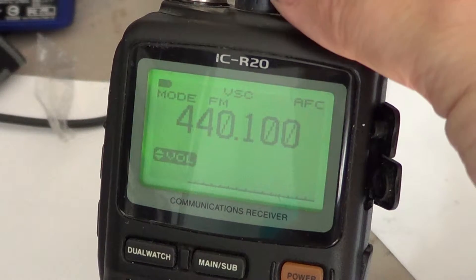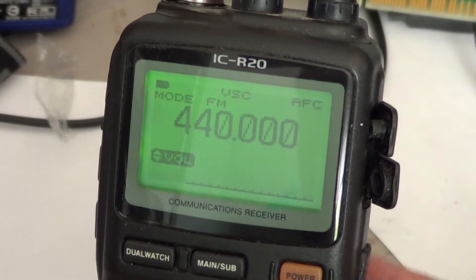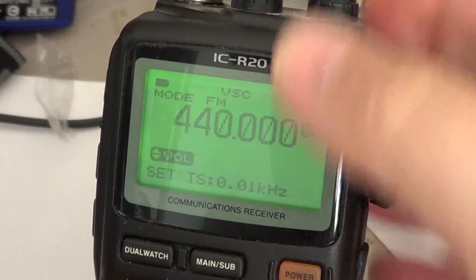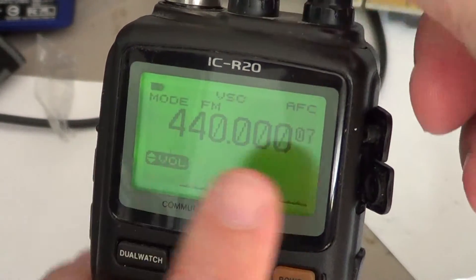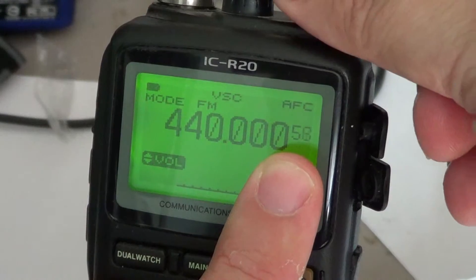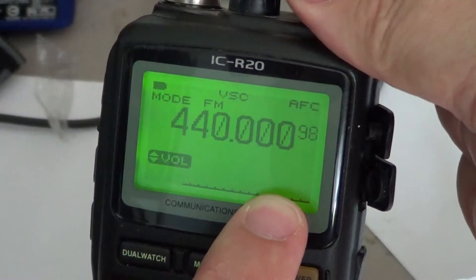You'll know it's working because while tuning manually you'll see the steps jump at the value you've chosen. As an example, if I put it at the very low end of 10 hertz — press and hold nine, go to 10 hertz, press tuning step — you see a smaller set of digits added to the frequency display, and if I tune, only those digits change. Now I'm tuning in very precise 10 hertz steps, which is why there's an added smaller number on the upper right.